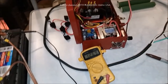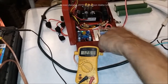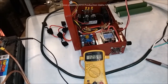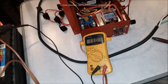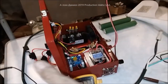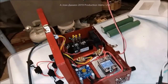We're going to run it up so you can see the current status — we're at 12.68 volts on the battery. I'll hold on to this and you'll watch the voltage jump up. It got real hard to turn there — that kicked on because the battery was full and put a load against the turbine, slowing it down. In a bad windstorm this controller prevents overcharging your batteries.